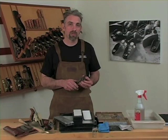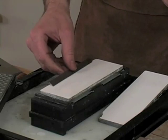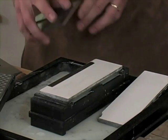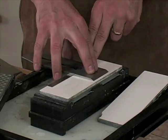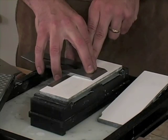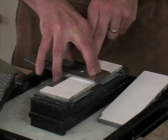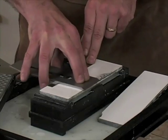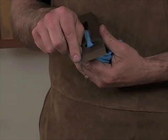David Charlesworth came up with an idea he calls the ruler trick. This is simply taking a thin metal ruler, about 20 thousandths or less, sticking it down to an 8000 grit stone with the suction of the water on the stone, and then working off the opposite side of the stone with the back down and even pressure in the center of the blade. Don't come more than half an inch onto the stone and work on and off the edge, traversing the length of the stone to spread out wear.